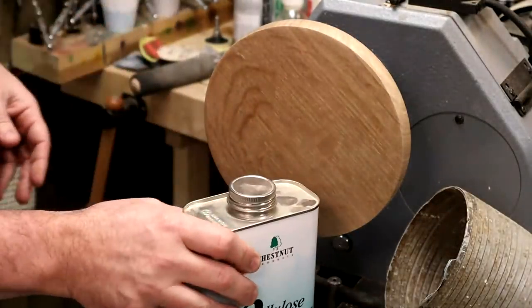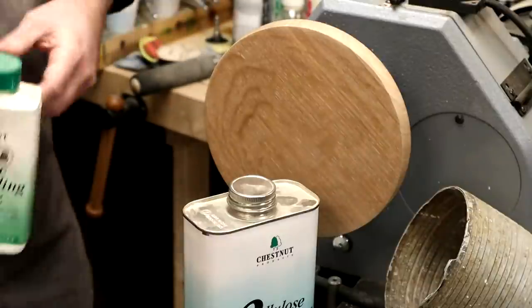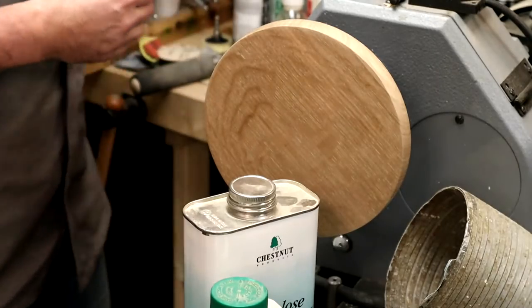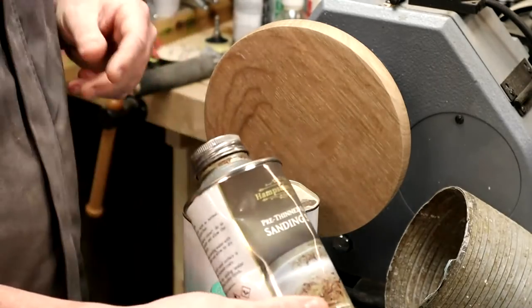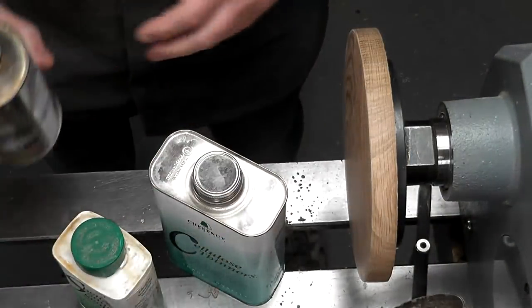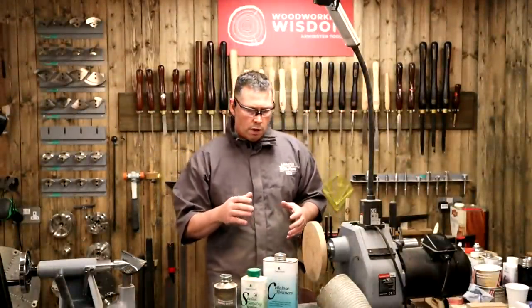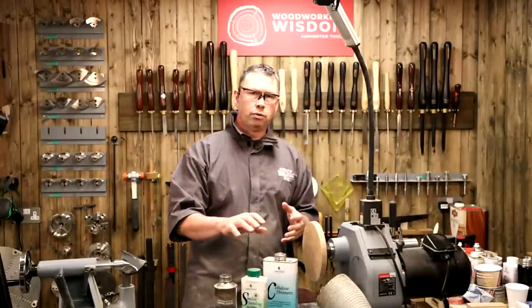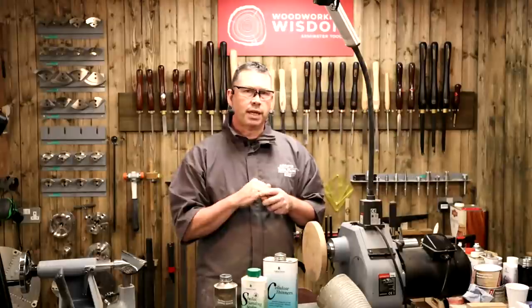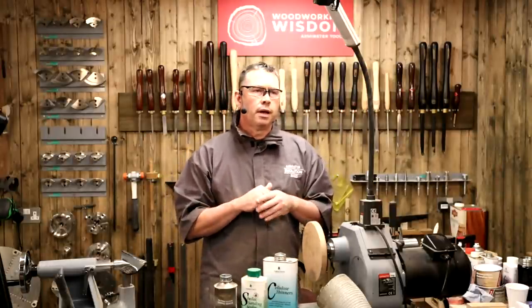This one is the cellulose sanding sealer by Chestnut, or shellac sanding sealer. You can get pre-thins. There's another one. This is a Hampshire Sheen. So this is a pre-thin sanding sealer. And in terms of sanding sealers, there are quite a variety. So the one I prefer is cellulose. We dilute the cellulose here quite aggressively. It can be anything sort of 50% thinners.